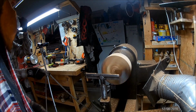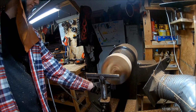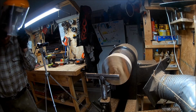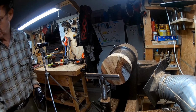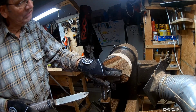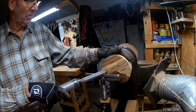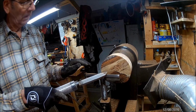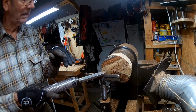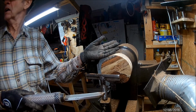That's good. Shut the machine down. Counterclockwise. Counterclockwise. All right. Now, let me tell you, you probably want to know what we're trying to accomplish here, right? What we're trying to do is we want this face right here, from about here to here, to be totally flat as possible, because when we get this flat, we're going to cut what we call a recess, and I'll explain that to you in a little while, but then that lets us flip it over to hollow out the inside.